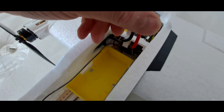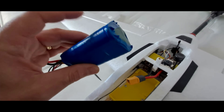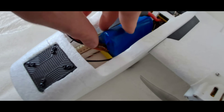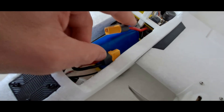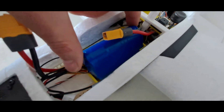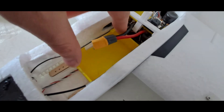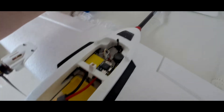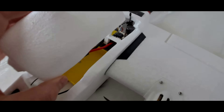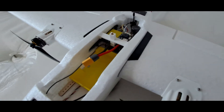I've made a long battery tray because I don't like having straps on batteries. This is a 3s1p pack with Molicel P42A cells, so it's 4200mAh. It just sits in there, you plug it in, and when the cover's on it holds the battery down. The tray means the battery can't slide anywhere. I've marked out where the screw holes are so when the battery's in there it's on CG — I can make more of these packs and know they're always on CG when slotted in. I don't have to worry about strapping it down, and obviously the wing spar holds it in so it's not going anywhere.